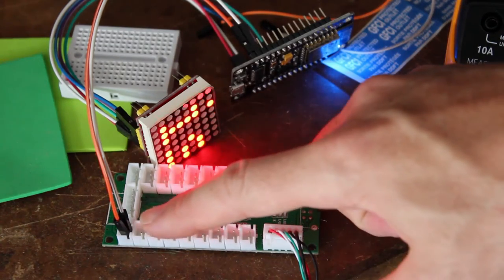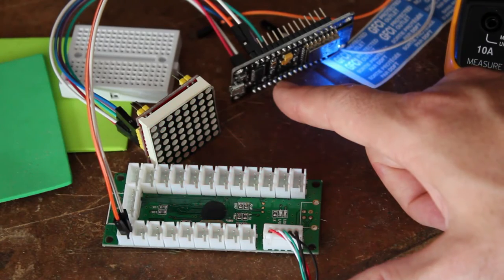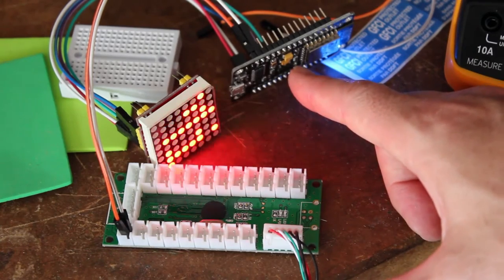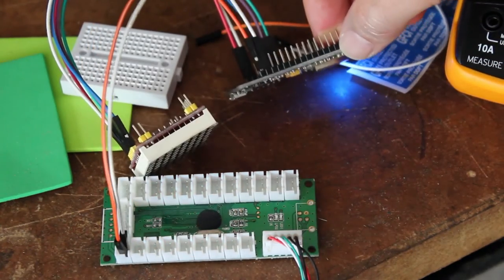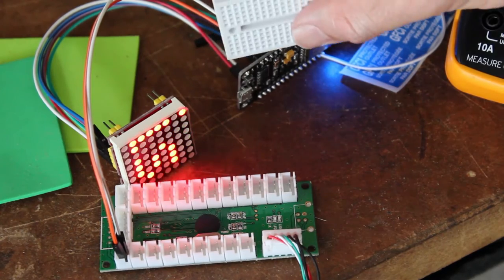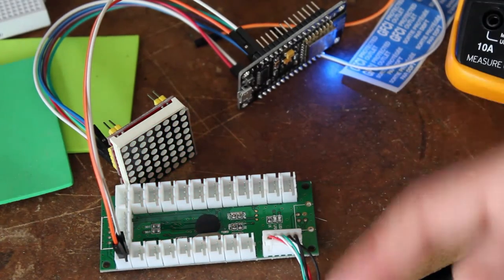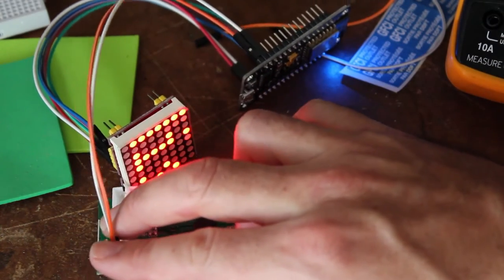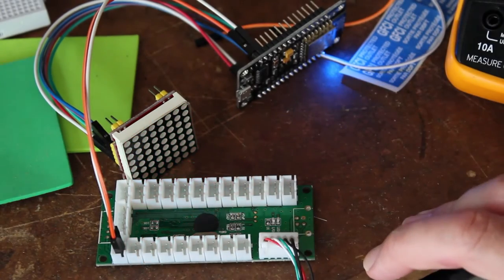I didn't have any two-pin connectors, so I just used single-pin female-to-female jumper wires, and I'm going directly into the ESP8266, and it seems to be powering it just fine. I'm still not sure 100% how I'm going to mount the ESP inside the board, because it does have mounting holes but it has these pins that are in the way. I might mount it facing down so the pins are up. If not, I'll just use female-to-male connectors and put the board on this little breadboard and mount the breadboard. But it is working — I'm getting power. One power line in through USB, and then to the ESP. I might put some hot glue there just to make sure those connections don't come loose once I close up the box.